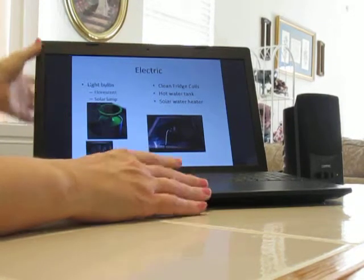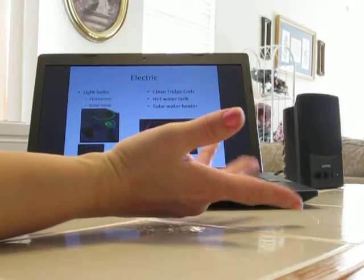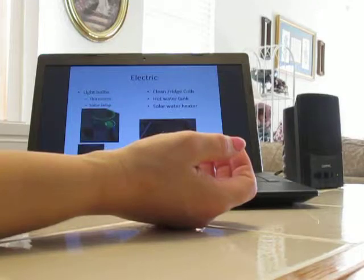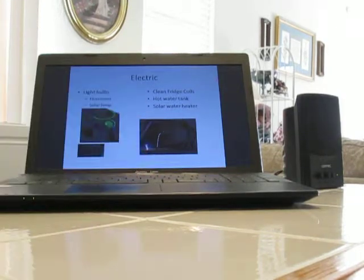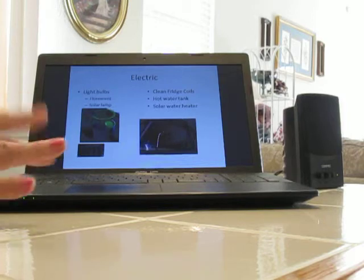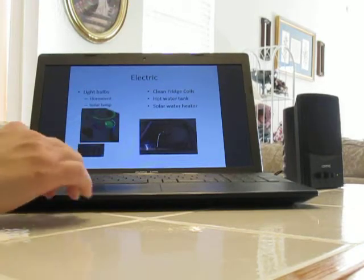Hot water tank, okay. Underneath it is probably aluminum foil, something reflective. And then you get your hose, and they usually use two huge hoses, and then just coil them up, spray paint them black first, and then just put like a window thing around it, and there's your solar water heater. And I've seen these without even the glass around them off of Jackrabbit Trail in the expressway I-10. There's a house that has two of these on the roof.